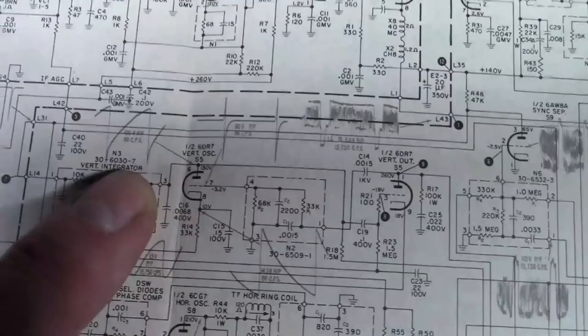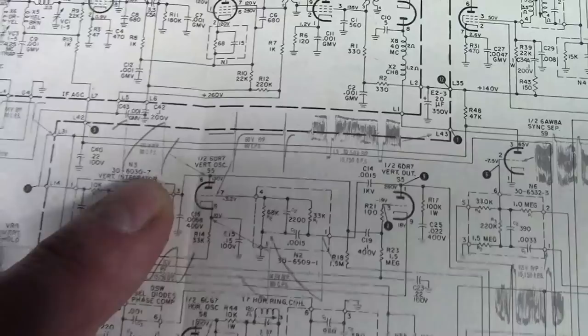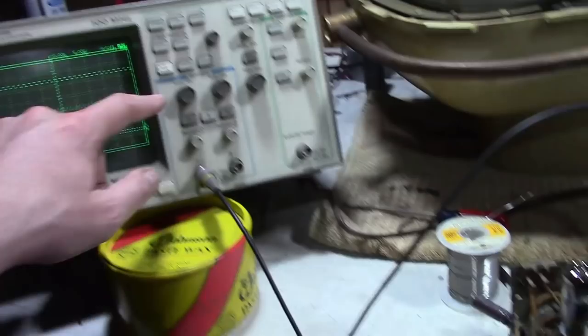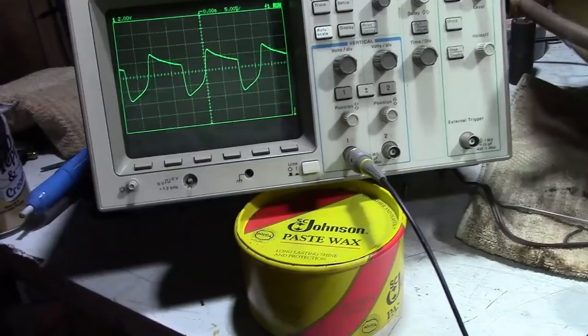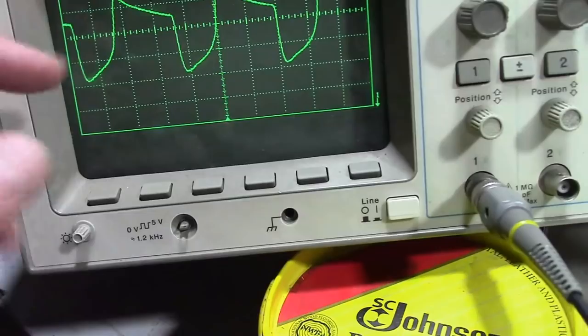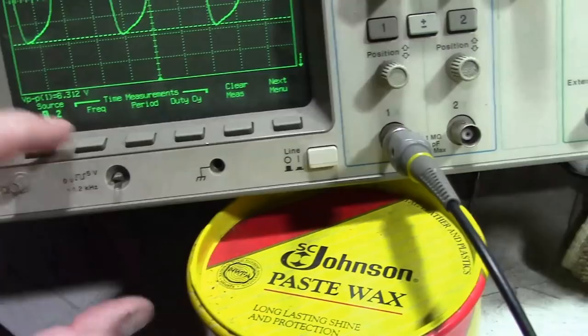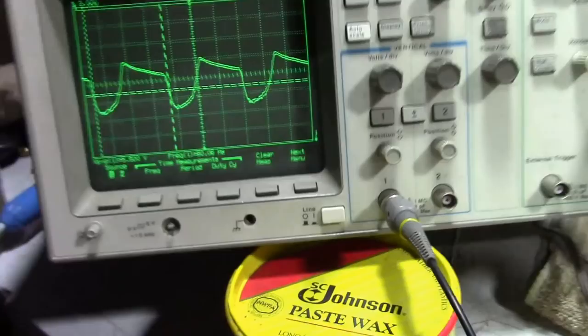Another power up. We should see pin 6 - 130 volts DC and 100 volts peak to peak, 60 cycle sawtooth. The tubes are all warming up. I'm going to crack up the speaker. Hit the auto scale button. Well, we got something but that ain't what we're supposed to get. About two volts per division, so nowhere near what it's supposed to be - that is six and a half volts peak to peak. That's not a sawtooth. But we got the right frequency. So something is really damping that oscillator.